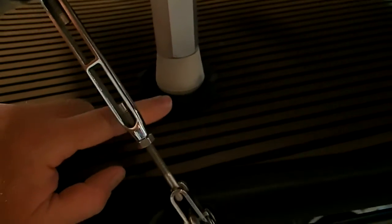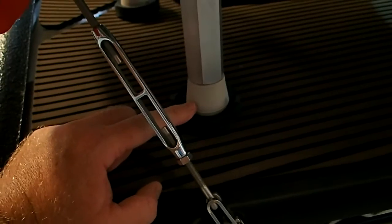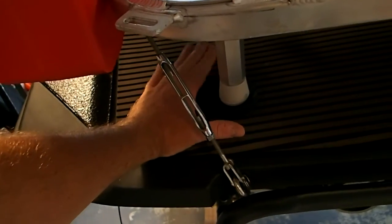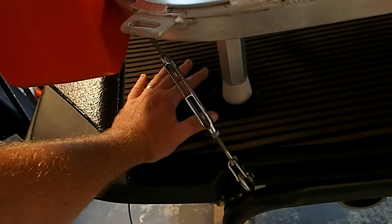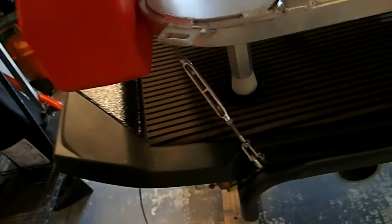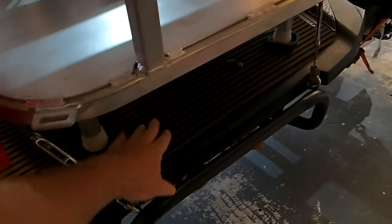I've added some extra rubber — these are furniture pads available at Lowe's and Home Depot — under here because this rack is going to have a little extra weight from the additional fuel. This is adjustable, so it allows for some range for different ski decks, whether you have a VX or some sort of Sea-Doo. The only consideration with Sea-Doo is some models have access panels, and the feet will actually line up with those access panels. It's not a good idea to install this rack on a Sea-Doo that has the removable panels. If you have that model, you may want to take measurements, give them a call, and see if they can move the legs to a different spot.